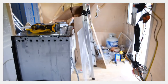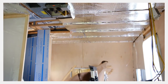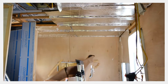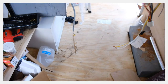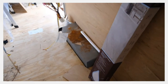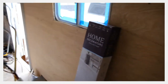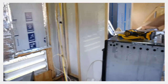I'm leaving the ceiling open right now until I figure out where these wires are going to go. The ceiling is going to be the next thing, and after I do the ceiling I'm gonna paint, then I'm gonna put the floor down. So the order of business is: frame out everything, put up the ceiling, paint, put down the floor, and get the walls all up.